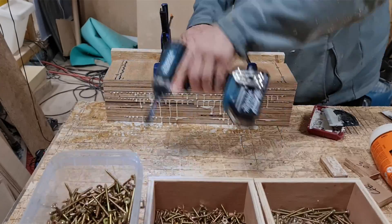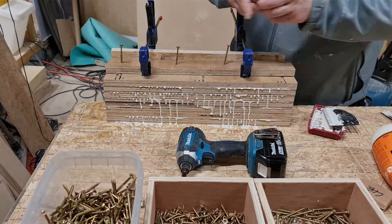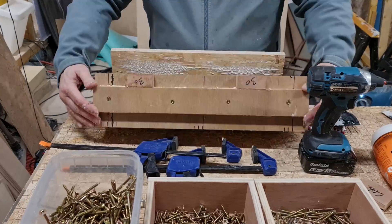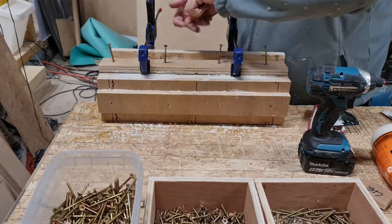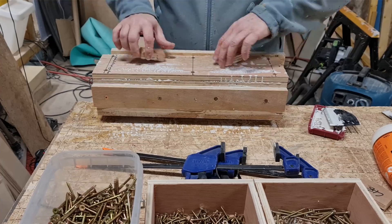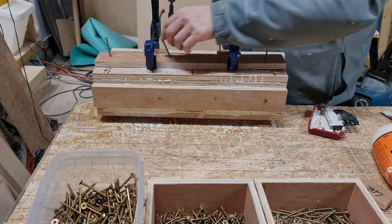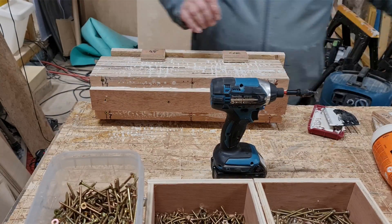Time to put on the spacers. Using a little fillet of plywood 30mm wide that gives the correct spacing — that's one done. Same again for positions two and three, but for position four you need a 48mm spacer so that the centre is put in the right place.